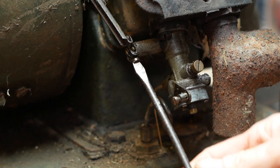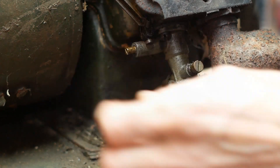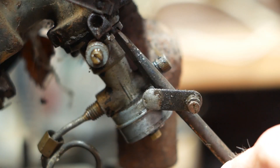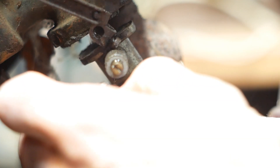Next, I needed to remove the cylinder barrel to clean it up properly, so the carburettor and exhaust will want to come off. The fuel is sucked into the carburettor through this thin pipe. It's a tiny little carb, and pretty basic from the looks of it — not least of all because it doesn't have a float chamber of any kind.